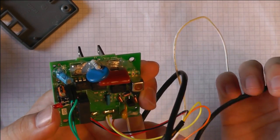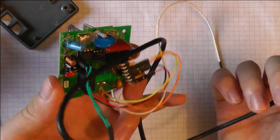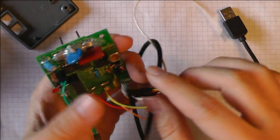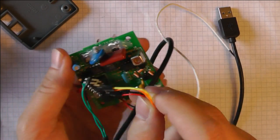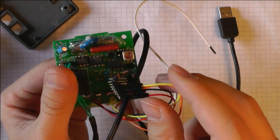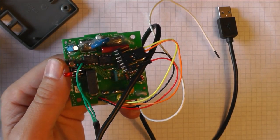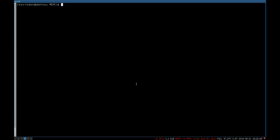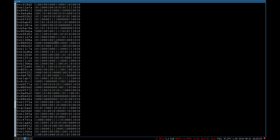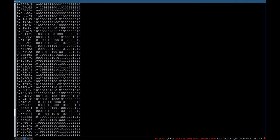Now that I have three receivers recording codes, I can dump all the codes via the I2C sniffer interface — it's dumped whenever the device powers on. We can parse all the dumped codes and see them with their bits. I want to analyze and find out if there is some kind of pattern for this building.